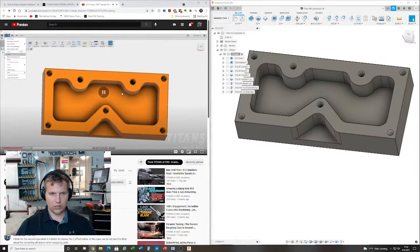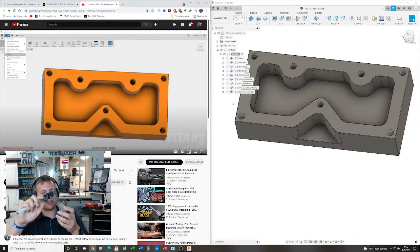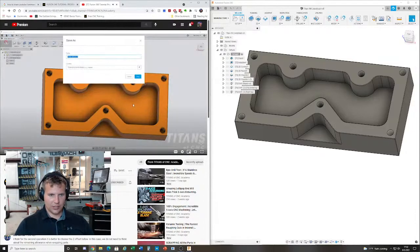What I wanted to do was actually make it clean. So I'm just gonna stop for a second. I just said we wanted to come up 230 thou on the bottom. I'm just gonna measure it real quick, see what we get. So I'm getting 0.199, so 199 thou. But maybe the actual part, I'm getting 0.97 there. All right, sorry for the interruption.